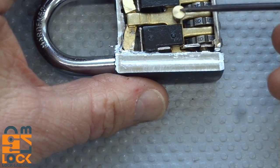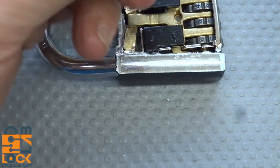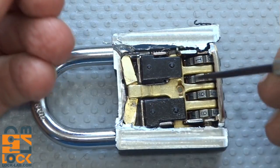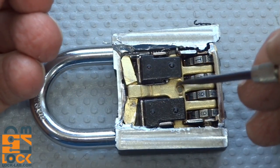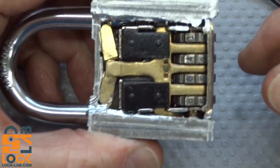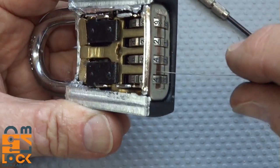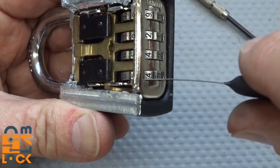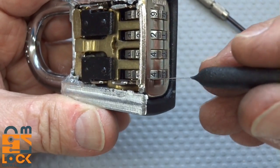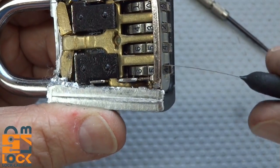On the inside here - and amazingly I didn't destroy it - is a little plunger with a spring. That just maintains downward tension on the locking pawl itself. Now here's where I screwed up: turns out you probably CAN shim this. If you go in from the first slot you're not going to be able to access anything, so they didn't bother to shield that one.